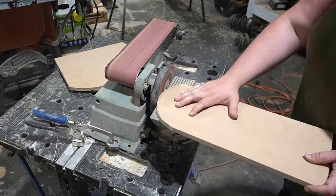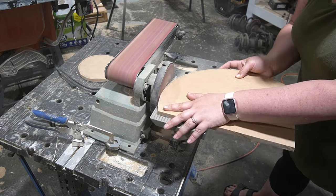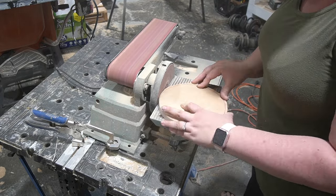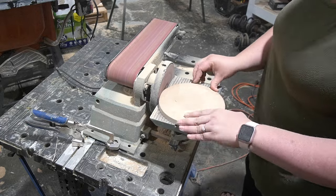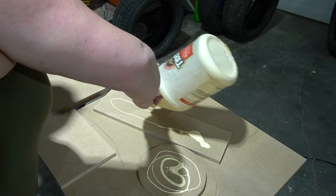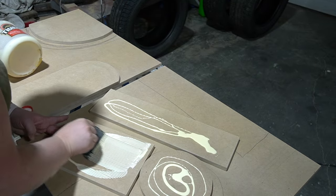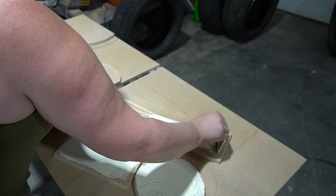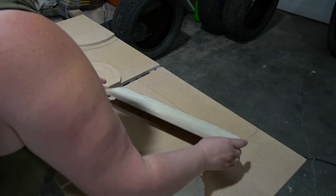Because I'm not all that accurate with the jigsaw, I sanded down all of those edges so that they were nice and smooth and round. Then I attached the MDF shapes on top of the MDF backing using wood glue. I used a little silicone spreader — I'll link it below because it's really great for wood glue — and spread glue around the backs, then nailed them in place just to hold them while the glue set.